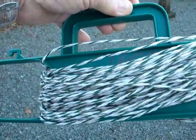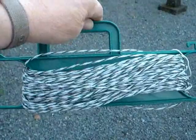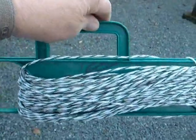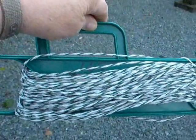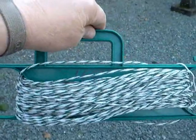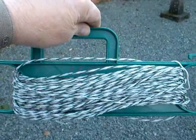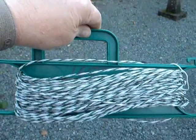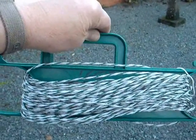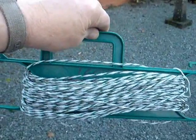Okay, just dealing with the simple wire first. The length of wire can be anything you like, but what you've got to remember, of course, is you're up against a 200-foot ceiling for your kite. So if you're going to use just a wire dropped off the kite, then it can only be 200 feet long. Or if you're going to use electric fencing wire like this as a flying line and an aerial, you're probably faced with something like 250 feet, bearing in mind that the kite probably runs at an angle of about 50 degrees.